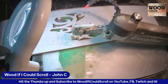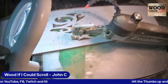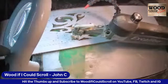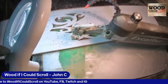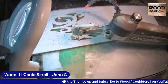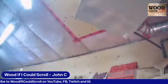Yeah, so I got a double detached two-car garage. It's 24 by 26, about 15 feet from the back of the house. And then I ran a gas line a couple years ago to get a furnace out back here. When I moved in, it was basically just a stick frame. Then I insulated it, polyed the walls and the roof, and put plywood. I got four-foot sheets on the bottom, two-foot sheets on top, and slapboard in the center of the wall. And then I got to finish the roof off. There's my furnace right above me.